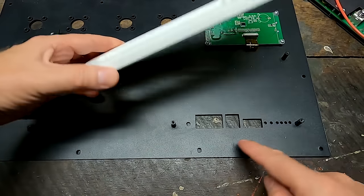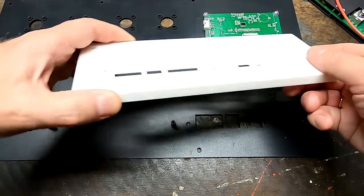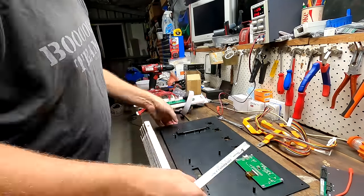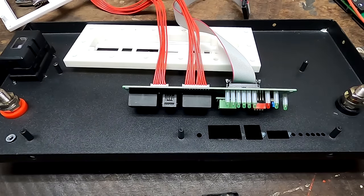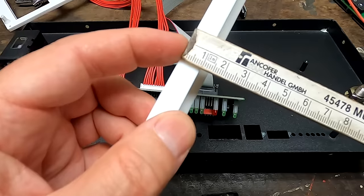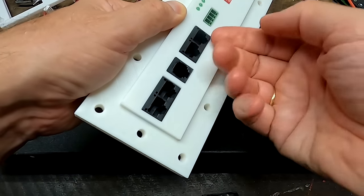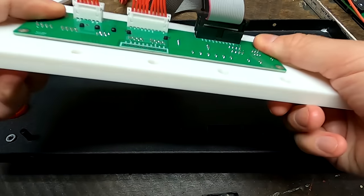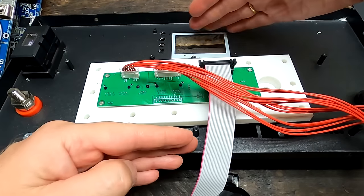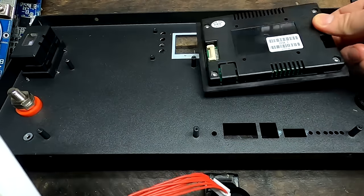But this one does not fit in the same location as these holes here — I would need to cut off two of these standoffs, but then the whole BMS mount is a bit wobbly. I've been trying for the last 20 minutes to get this arranged on this front panel, but it's really hard. This is like 10 millimeter here and 5 millimeter here — that's exactly the height needed so everything is flush from the outside. But regardless what I do, it doesn't fit. I believe with this smaller front panel for the 135 amp-hour battery, we can't fit a 4.3-inch display anywhere — there's just no room.